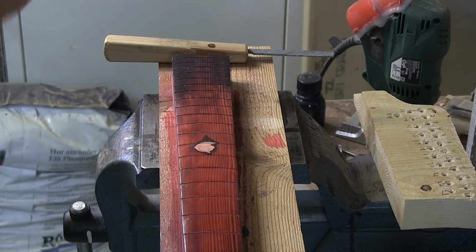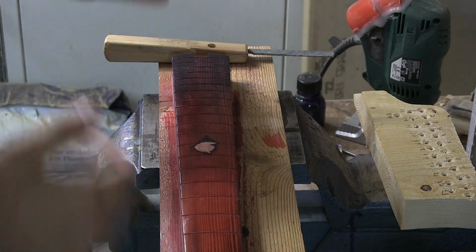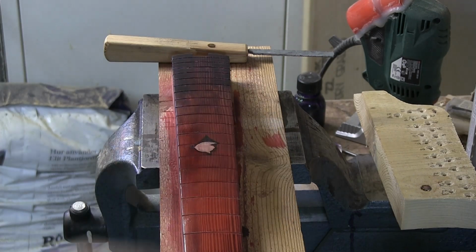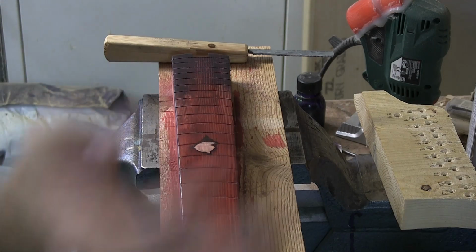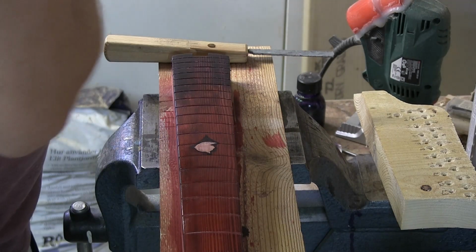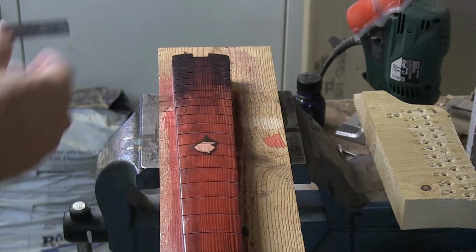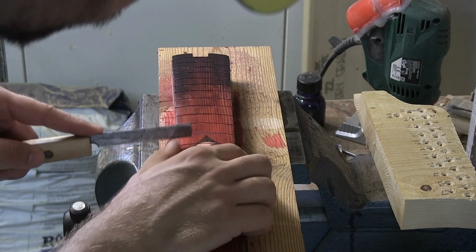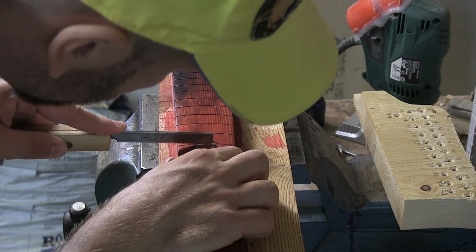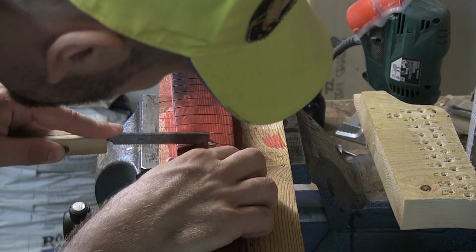But if it was just a maple neck, which you've seen me do before, I put in the frets and I either mask off the frets, or I just lacquer it, and then I can remove the lacquer from the actual frets afterwards. It's a perfect way to seep up the little gap and make the frets sit in there a little bit tighter.